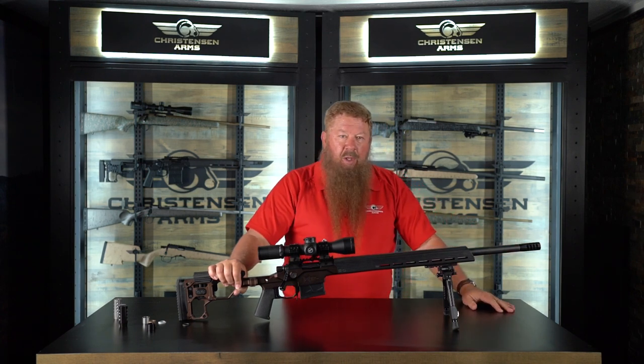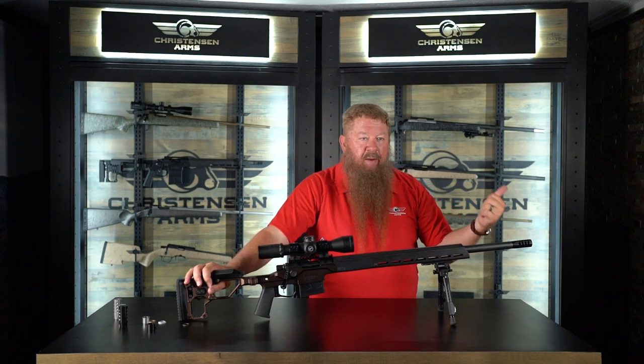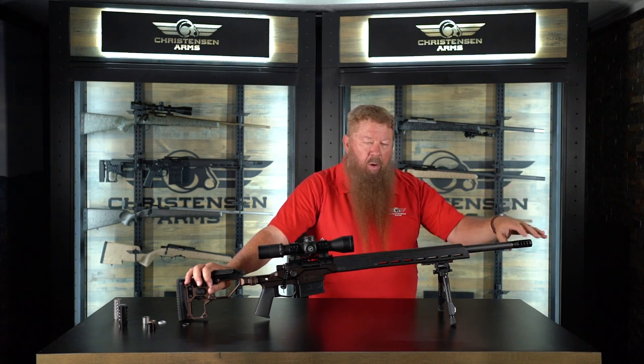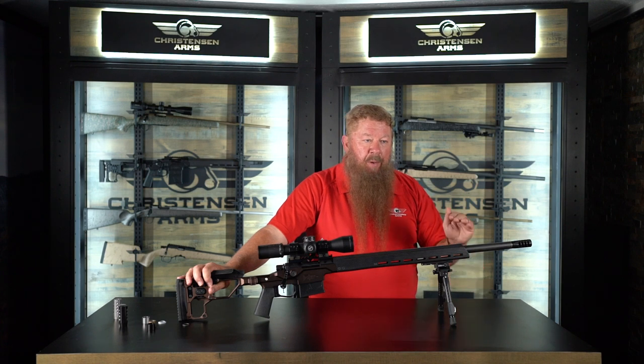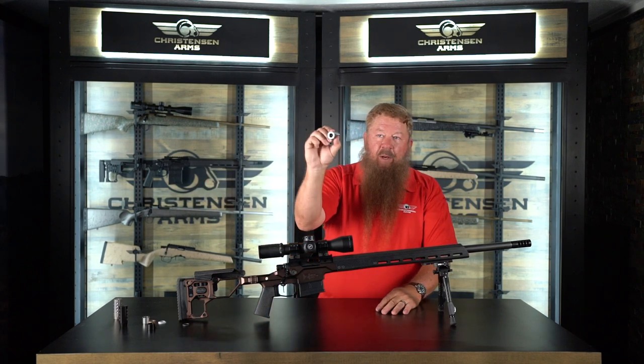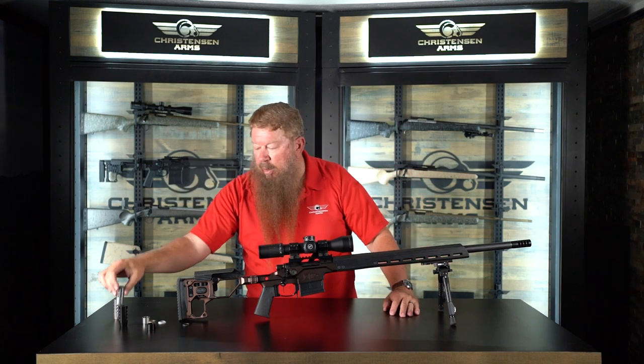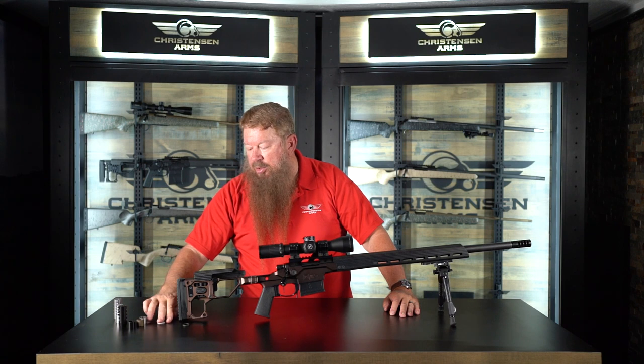As far as caliber goes, at Christensen Arms, we've done a ton of research, and what you'll find is everything that's above 22 caliber, that includes the 243, 264, and 284 calibers, or the 6.5 and the 7mm and the 8mm, will all work with a 30 caliber brake. The 30 caliber brake for us covers every application above 22 caliber. And then we do offer a 22 caliber brake. This brake right here in my hand is a 1/2x28 thread stainless steel radial brake in 22 caliber. A lot of this stuff we offer on the web store. We offer the thread protectors, the crush washers, and basically everything we're talking about is available right on the web store.